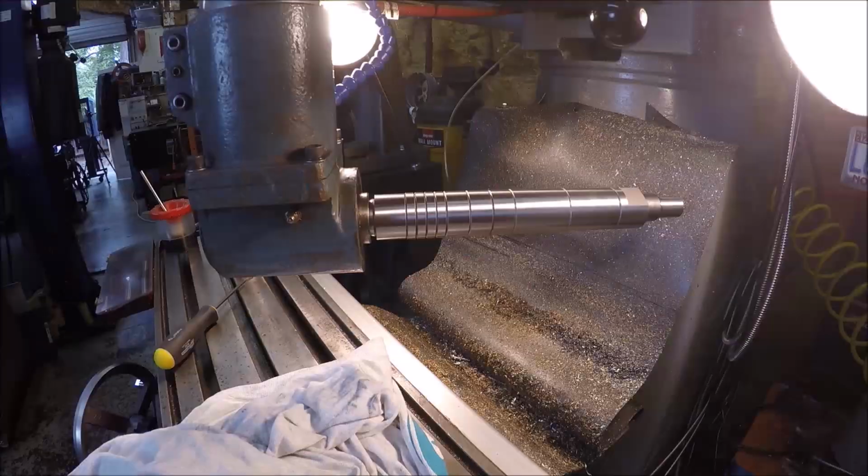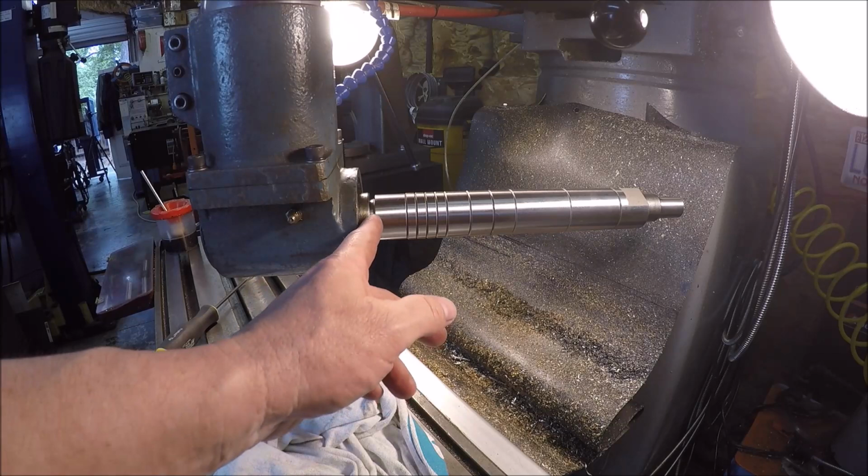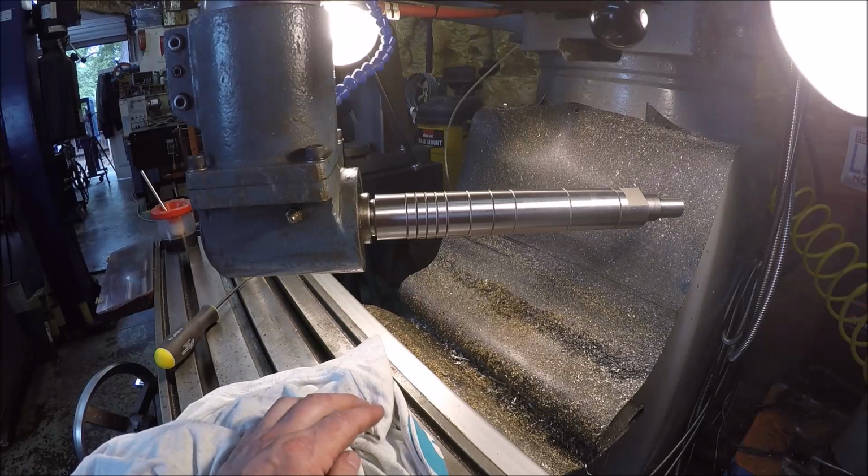So we got you over here at the mill to help visualize what we got going on. That is the right head, a right angle milling attachment. Obviously this is pretty versatile. You can run collets or a drill chuck. This is R8, and of course you can drill this way. You can run a slitting saw. You can cut that way.